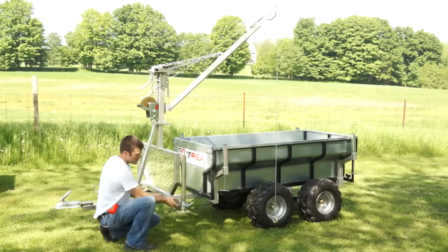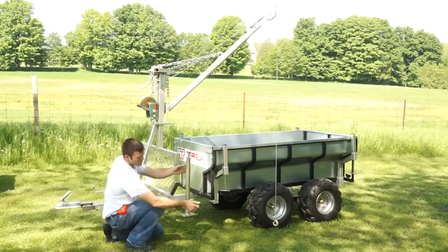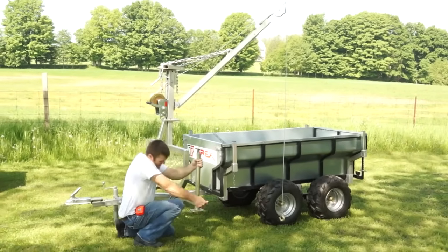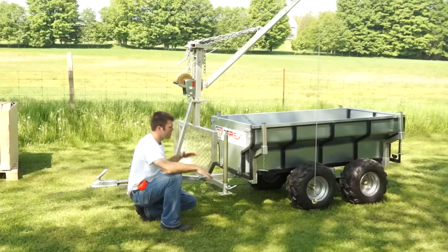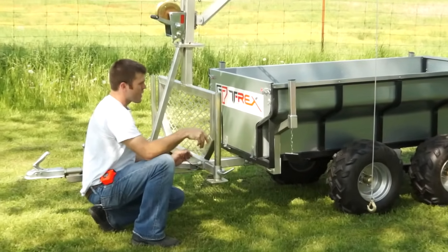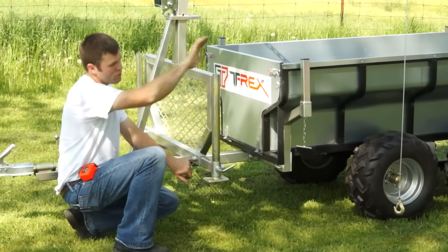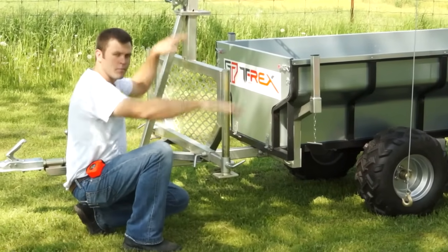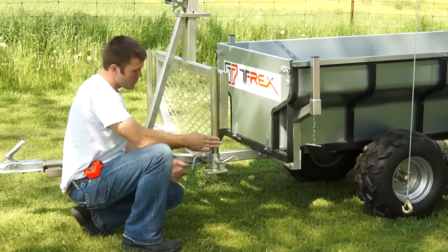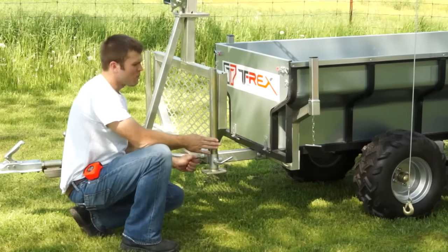These outriggers, again, are adjustable. And then the vertical will sit down and adjust to whatever you need it to do based on the terrain you're on. So if you're on a hillside, you can set up for that. Left to right, you'll want to put the outrigger out for whatever you're winching so that you basically stop it from doing any kind of twist. During travel, these should be put all the way in, out of the way, so you don't get hung up on anything.